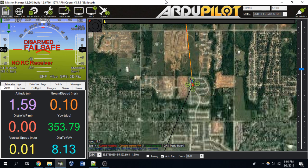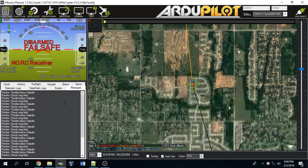The easiest way to tell what that problem may be is to open up your ground control station — in this case, Mission Planner — and go into the messages portion. Here you'll see some messages being sent from the firmware. You might be told that your throttle is below fail safe, or you may see messages like GPS glitch, compass variance, or accelerometer calibration needed. The information you'll need to determine why your drone isn't arming will probably be in this messages section.